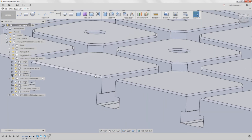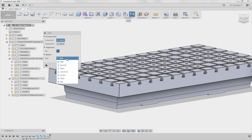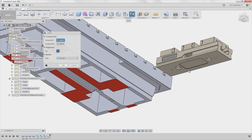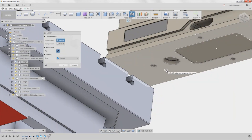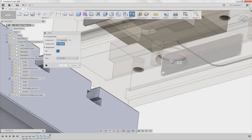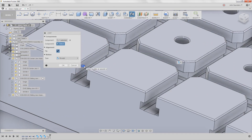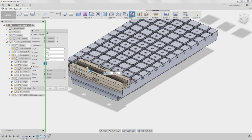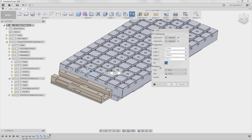Click OK. Assemble joint — now I started with pin slot, that's the wrong one, but I'll show you. Component 1 — remember that's the component that always gets moved. Hold control down with my mouse right here — that lets me come in and pick this, the bottom of the vice body and the center of that ring. Component 2 is that coin I just created. So pin slot lets it pivot around like that — that was the mistake. Easy to fix: just change the type to slider, and now you can see — perfect.